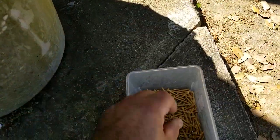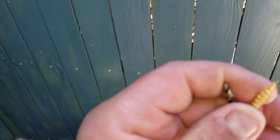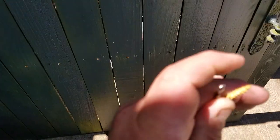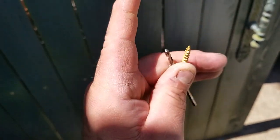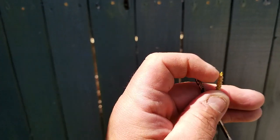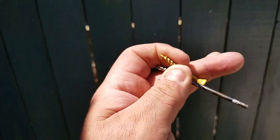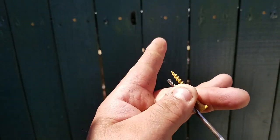You just find a drill bit that has a smaller shaft, just a little bit. That way, when you look down the center of them, you'll actually see that it will still bite into that metal. Whenever you drill, it'll bite in like this — the metal of the frame would basically be the nut. That way the rings on the screw will actually bite into it. At the same time, you want it to suck the wood in when it's biting into the metal.